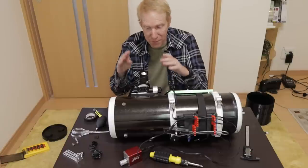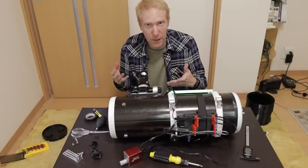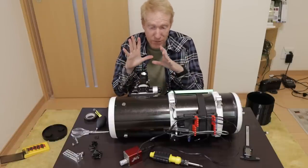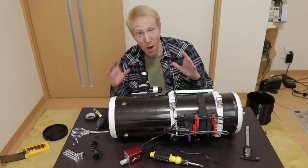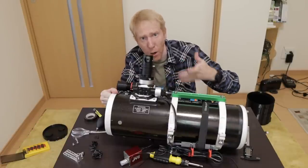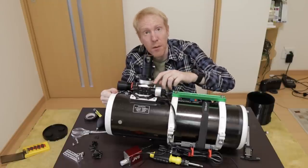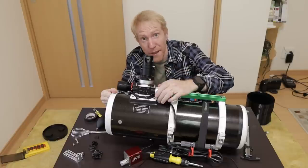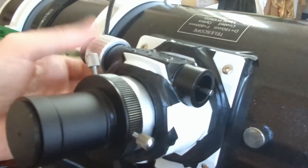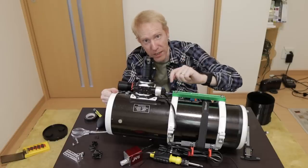While doing so I covered up some tilt adjustment screws for the focuser draw tube assembly, which I think I'll need to mess with during further touch-ups of the telescope alignment. Another thing I did with the focuser assembly is I taped around the focuser draw tube itself — the idea was to rack in the draw tube with electrical tape on it so it heats up, removing the gap between the draw tube and the focuser assembly. It seems to have worked.